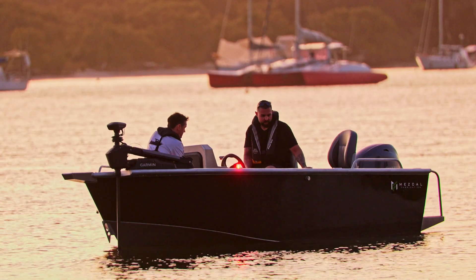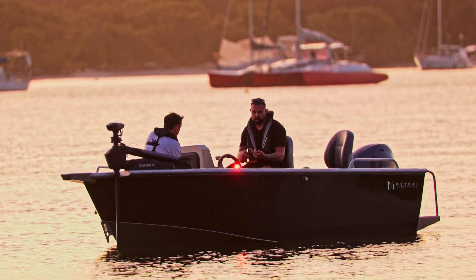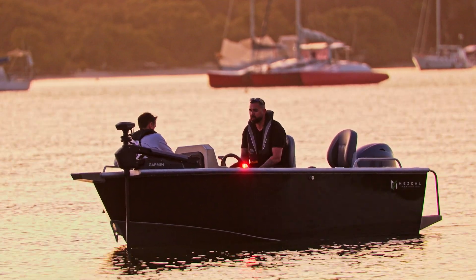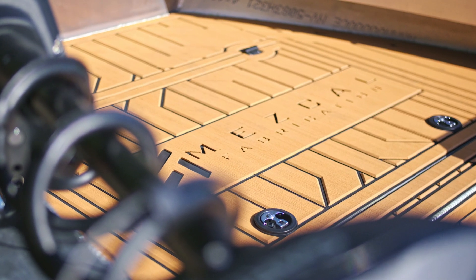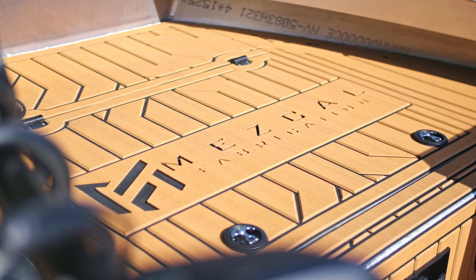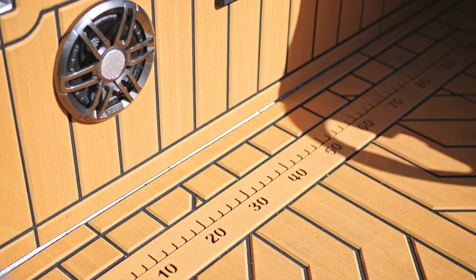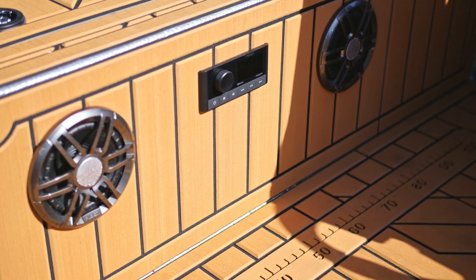These are Sam Allen seats — Sam Allen's really good. You can go and build out your whole boat. Everything drops in and all the hatch holes are made to fit. Even the latches — those latches are meant for 19mm marine ply, so you can't actually tighten them up on plate, it's not thick enough. That's why they work around the deck armour — we've actually used the thickness of the deck armour to give it the depth it needs so the lock grabs.